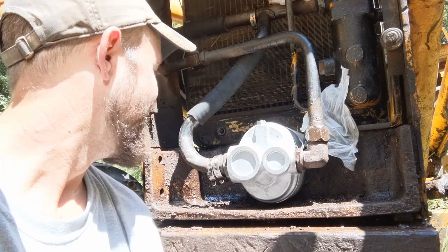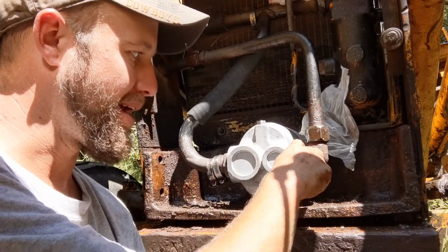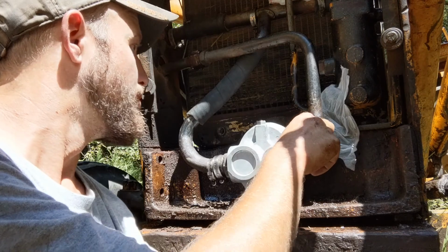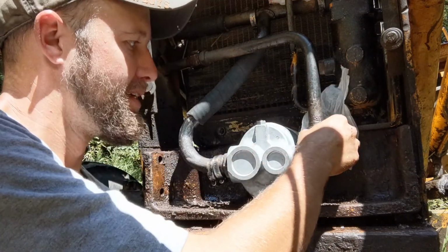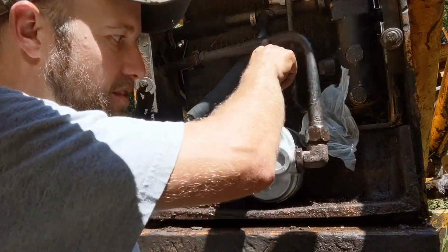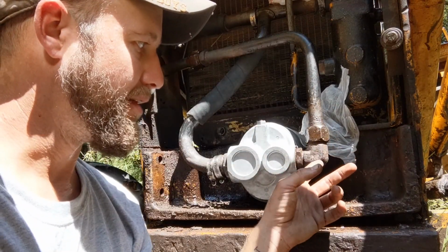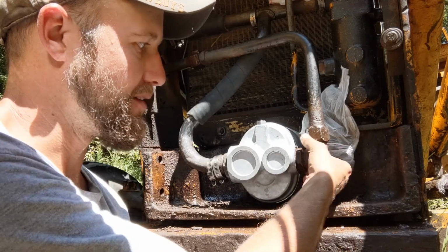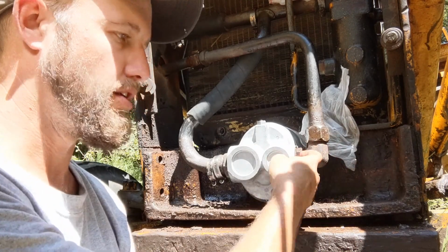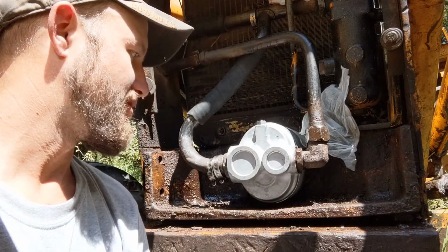And the last thing to note, now that I know how these come apart down here, you could have taken this swivel off and got this hose just out of the way, and then left this actual piece of the discharge line in place, and then just unthreaded that out of there, and you're not going to have to fight getting this realigned because you just put it wherever you need it, and then you tighten that down at the end. And so, man, that makes everything easy. Same thing on this side.